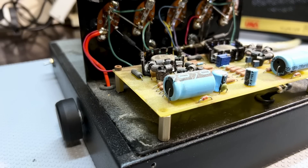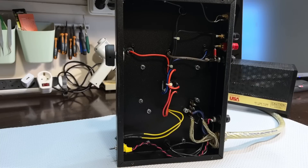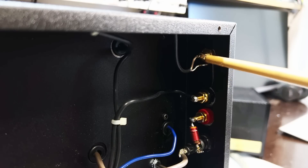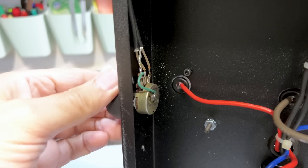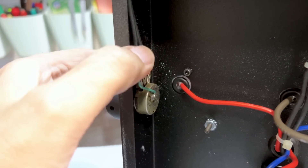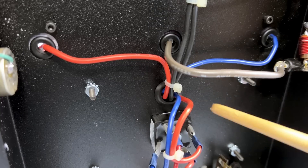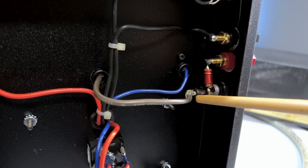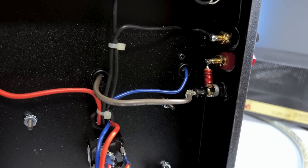There are obvious signs moisture got in here. That screw there is completely rusted over. I'm going to have to lift this board up, remove those spacers and screws, de-rust them, and make sure all these solder connections have not been affected either. Solder would not react the same way, but I just want to make sure everything is in good shape before I close this up. Looking at the underside, when you see what's on one side and then look on the other, you realize this person really does like things to be simple. Our signal comes in from the RCA jack, goes to the volume control — just a straightforward volume control — and the signal wiper comes out and goes up into the amp section. The outputs come out through a fuse, a small inductor, to the positive terminal for the speaker. That's our output section, done.